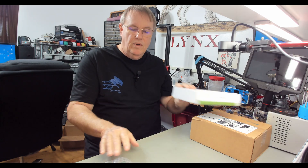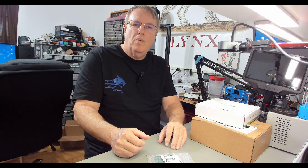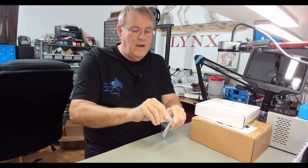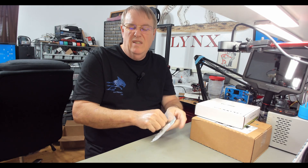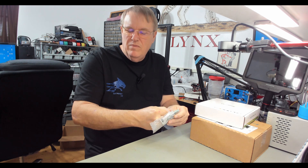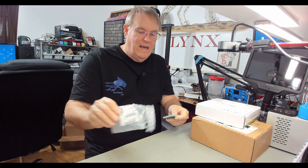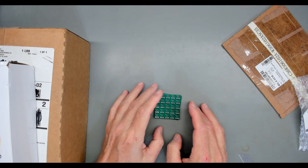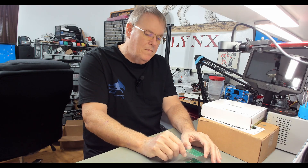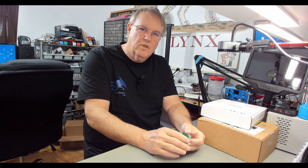We're going to make up some of these — going through the process of stenciling, reflowing, and cutting them apart. Because of the cost difference, having them V-scored would have been like $68 as opposed to $5 if I just had them made flat. So I added enough spacing between them to work perfectly for my little PCB saw. I'm going to build a rip fence to just slide them through and cut them apart, then throw them in the ultrasonic cleaner. I'll hang on to a bunch for myself and put some in the store.